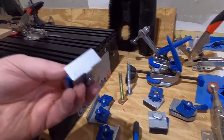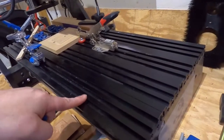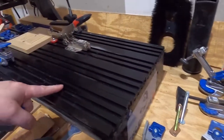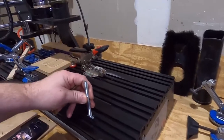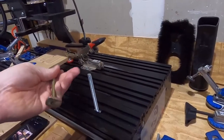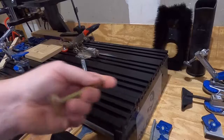One of the first things to consider is these stops and how they fit. Most all that I have fit on the t-track. A lot of CNC machines are going to have t-track like this, and you want to make sure your clamps fit into the t-track. There's going to be a carriage bolt of some sort that fits in. Some t-tracks fit a different size, so these won't work if you have the larger ones on this particular bed.